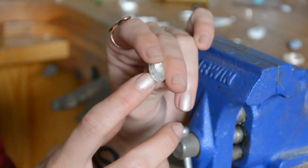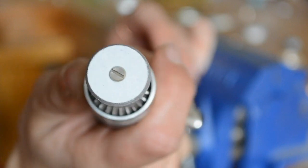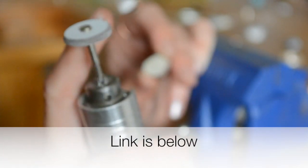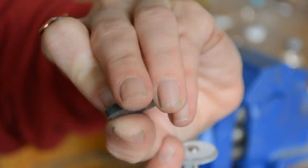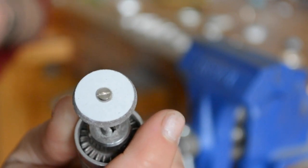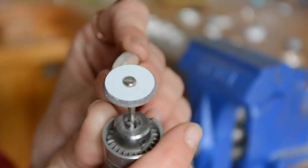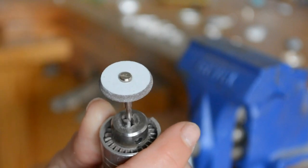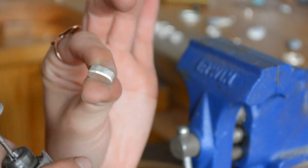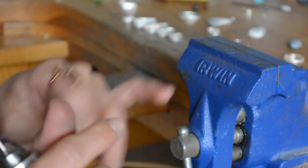A few people on my Instagram were asking how I take off metal with these wheels. I recently got into using this really awesome white wheel. I normally use these black wheels from Rio Grande, which you've probably seen a million times — these work great. The white takes off a bit more aggressively because it's coarse, and the black is medium. I'll link the white ones below. I go in with the white first to take off any excess metal that the larger wheel didn't get, trying not to get too close to the bezel wall, then I go in with the black one to prep it for soldering to the shank.